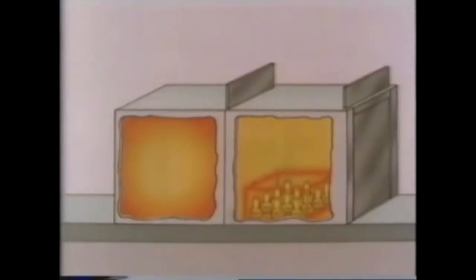The major disadvantage is that the component now has a coarse, crystalline grain structure. This has been caused by the length of time spent in the furnace at this high temperature. So, after cooling slowly in the outer vestibule, the next stage is to refine the grain of the bulk of the material, the core. This, remember, contains 0.1% carbon, as the original did.